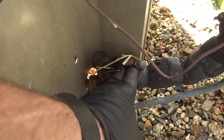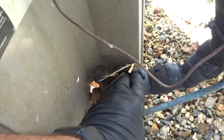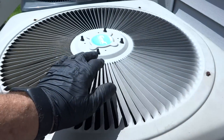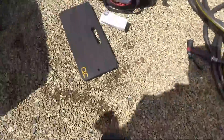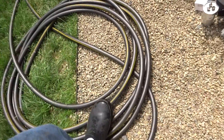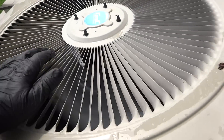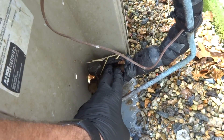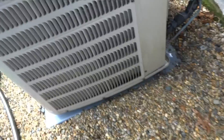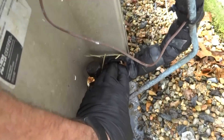It's been cool and okay, right? Yeah, she's getting nice and cold. We just hit this with the garden hose — not crazy bad, but every so often you should clean these coils with the hose. Alright, so we just rinsed them both off. Yeah, it has been cooling alright. I did cool it off pretty good when I hit it with the hose, but she's getting nice and cold now.